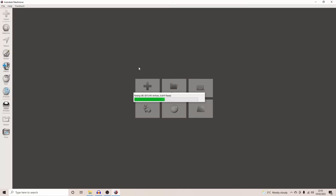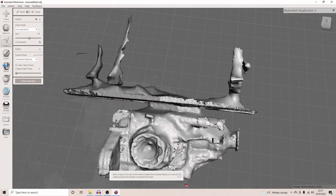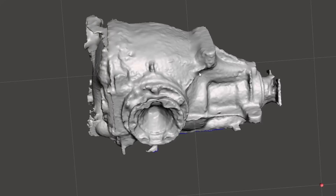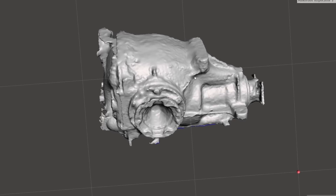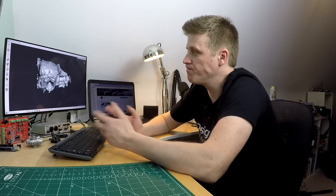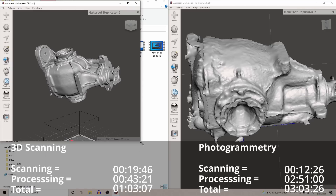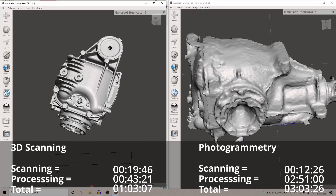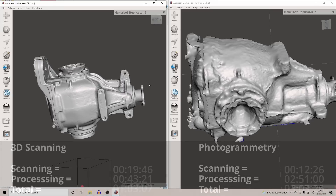Now it's time to finish off the photogrammetry. Back in Meshroom for the second scan — the one where we used the developer spray — we've got a result. It's a little messy, but you can see within the mess is a differential. We remove the mess using the editor function in Meshmixer, and there you have it. It's recognizable as a differential, but it's lacking some features — you can see bits of the flange, you can see the drive cups — but it's not going to be useful for pulling any dimensions off or for detailed engineering. Loading them side by side: on the left the CR Scan Lizard result, on the right the photogrammetry. You can see the flaws in the casting, the bolt heads — there's real clarity on the left, but on the right everything's a bit messy and it just doesn't quite work.